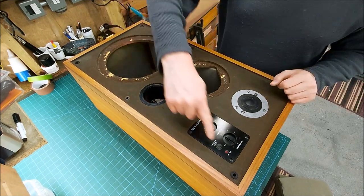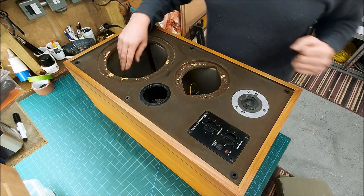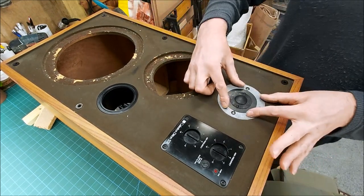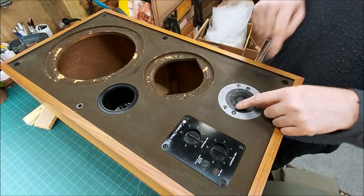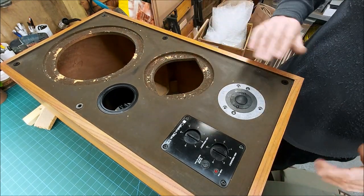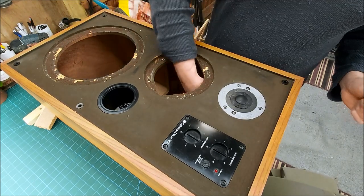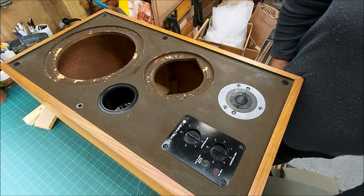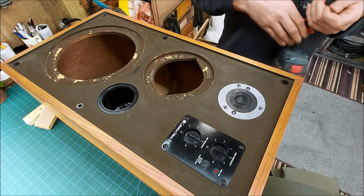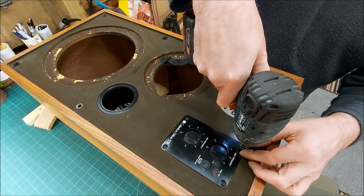In terms of foam, we've got one giant piece that goes all the way around and then a piece here and a piece here covering the crossover. No matter what I do, this tweeter won't come out, and don't pull them from the front because you'll tear the front plate off and rip all your lead wires off the dome. I've tried levering it and jacking it from behind — it's stuck fast. So we're going to have to work with that in there. I can get to the connections at the back, so whilst that will be fiddly I can solder on the new cable. This tweeter has been out before and re-glued, so I'm not sure what's gone on there.